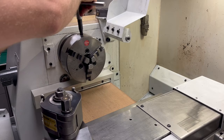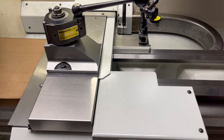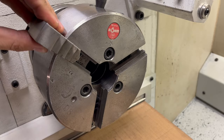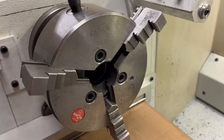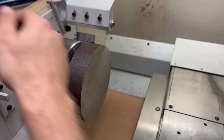For now, I'll use the default 3-jaw chuck. With just 3 points of contact, I can be sure that the grip is equally distributed. So let's switch to the outer jaws. The jaws are numbered, and each of them must go into their slot in ascending order so that they close properly. This chunk is quite heavy — definitely the biggest chunk of metal I've machined on this lathe.